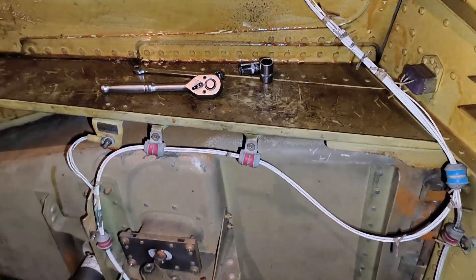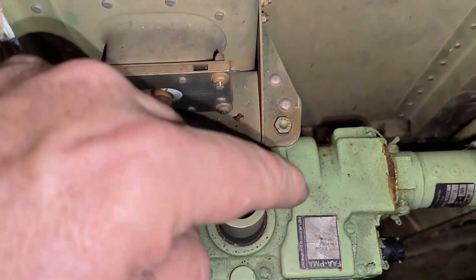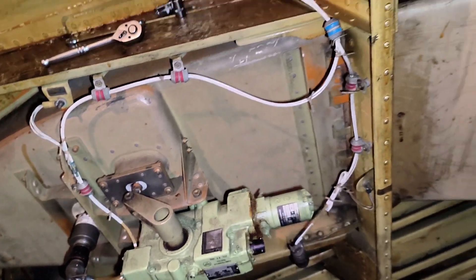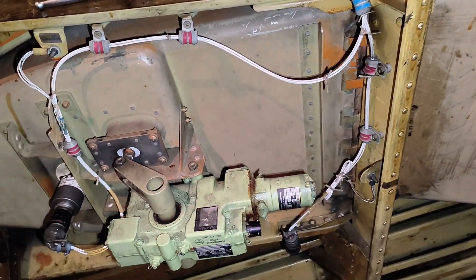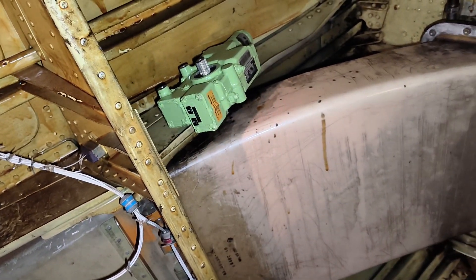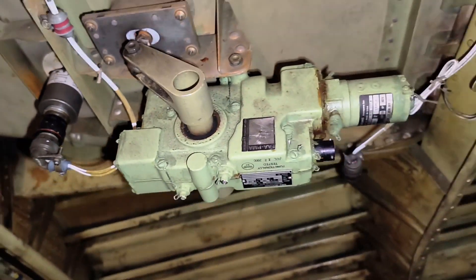The tooling has finally arrived - there are a couple of sockets waiting for an extension so I can get down this little hole and get that nut and bolt. After I've changed that one, I'll probably stand inside here while they try to start the APU so I can see what the new motor is going to do. It's going to be a bit noisy, but somebody has to stand here and just have a look at what is happening.